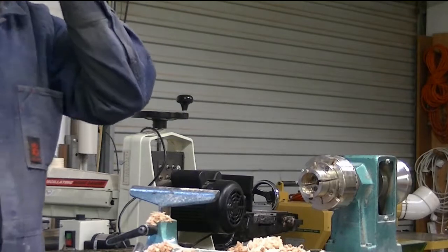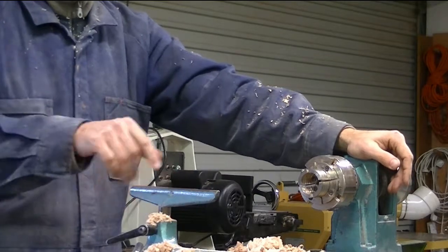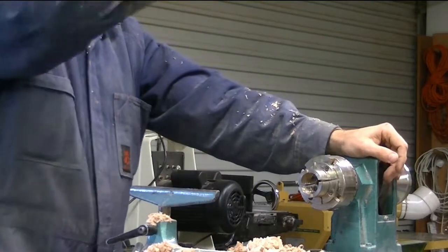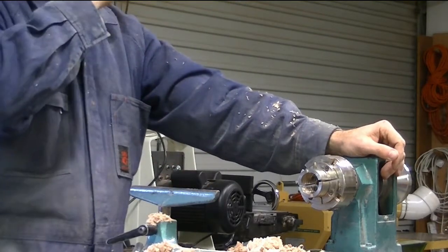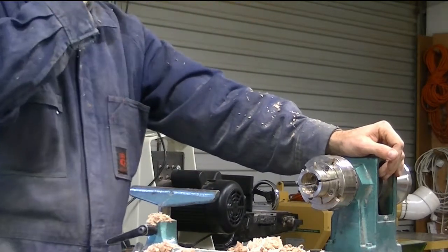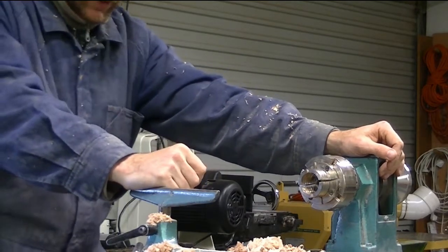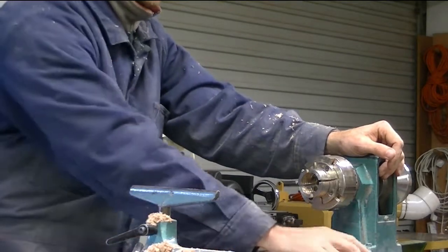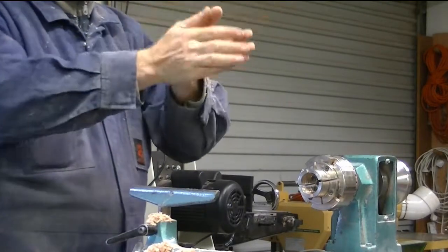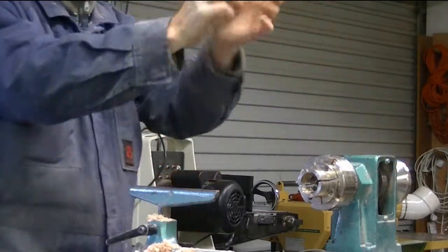And actually I saw one at one of the bays there, someone had made a pencil box out of exactly the same kind of thing. Natural edge, simple foot, deep hollow, and I think that one actually has the evidence of a Forstner bit used in it. And I find for that kind of deep hollowing, for pencil boxes and things like that, having sloped sides, which you'd normally end up with if you're trying to hollow, works out just fine.